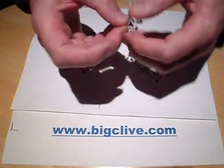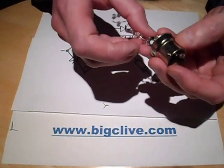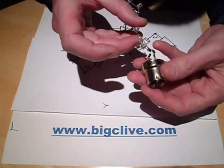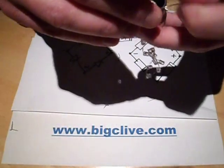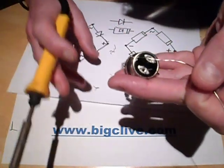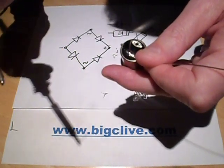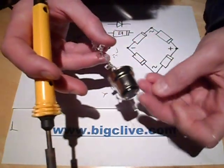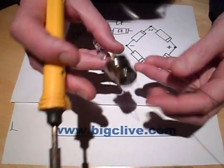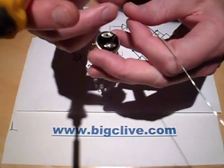I'll put the two tails into the base. This is a bayonet cap lamp holder because that's what we use in the UK. I want the components to be visible because I think they're quite attractive when visible in the lamp. I'm going to flow a bit of solder onto the terminal. We use bayonet cap in the UK - it's just a traditional thing, in the same way that in America lamp holders are traditionally Edison screw.